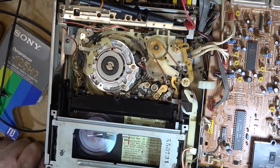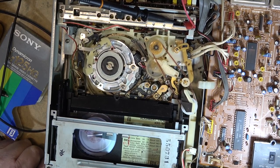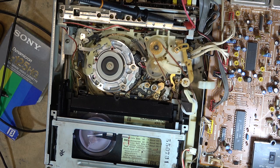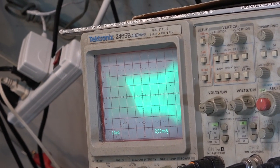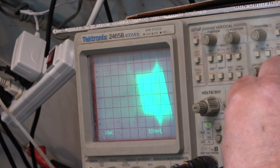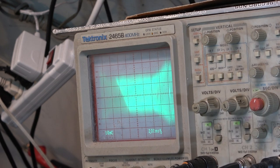So we can also check the beta 3 portion, so I can forward on this as well. The next one that comes up is color bars. I think it's in beta 3. Yes. So that will come up at the 16 minute mark, which is right now. I'll have color bars in beta 3, and they look perfect. If I look at the scope, we'll see that the waveform is perfect. So that's our waveform. One field, we'll look at both fields for beta 3. It's looking good. If I adjust my tracking control, it's perfectly flat.